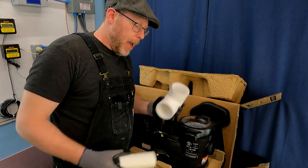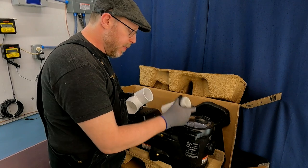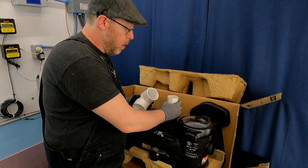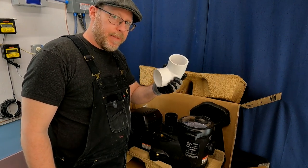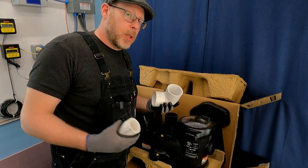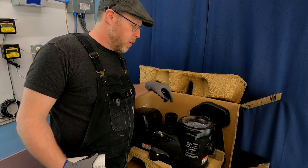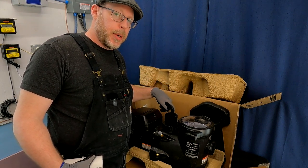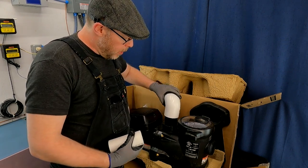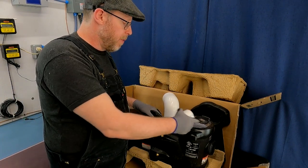Here I have two-inch PVC pipe, and here I have a two and a half inch PVC fitting. The PVC pipe is going to solvent weld into here, or you can use two and a half inch pipe. If you have a very large swimming pool system using two and a half inch pipe, this is an advantage of this pump — most pumps are not going to have this natively-sized port. They'll be smaller and probably won't fit two and a half inch pipe. But this one does; you can glue two and a half inch pipe right onto these union fittings.